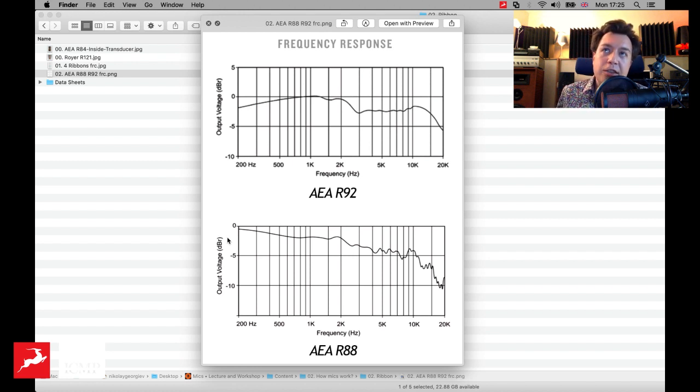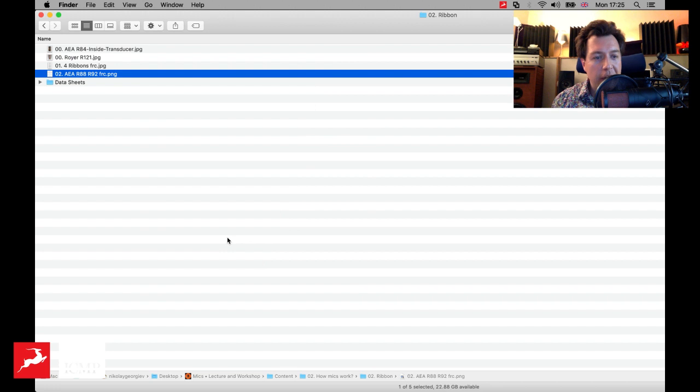That's not always necessarily true — for example, I've used the SE Voodoo mics. These are really good ribbon mics and they're actually quite bright in the top end. They don't have that dark top end. So generally speaking: dynamic mics have a pronounced mid-frequency peak, they lack a bit of top end, and usually lack some low end. Ribbon mics, quite the contrary, will have quite a bit of low end — a lot more so — a very natural mid-frequency range, and then have a drop in the top end. I'll get back to these phenomena and try to explain them a little bit better.